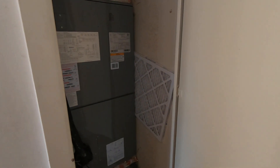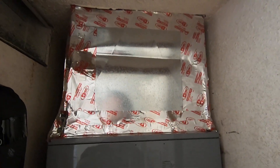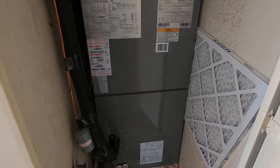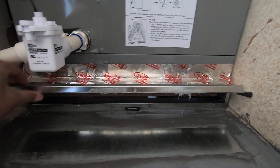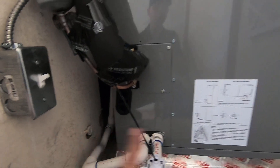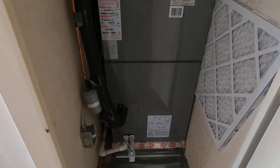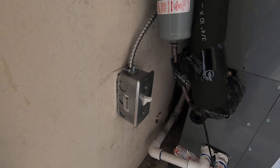In this closet you can see the fan coil. On top we have the supply plenum where the air flows through and goes through the ductwork. This is the unit itself — the 40MUAAQ 30XA3 variable speed fan coil. On the bottom we have our filter; it's a 20 by 20, 1-inch filter on a rack. The unit itself is 21 inches wide, 21 inches deep, and 49 inches tall, so it fits back in a closet where a furnace was. There was a furnace here — we took that out and converted everything to an all-electric heat pump system.